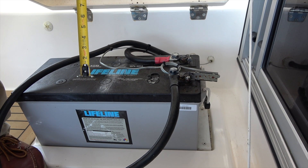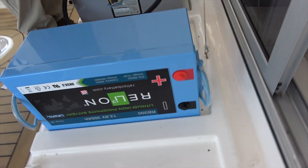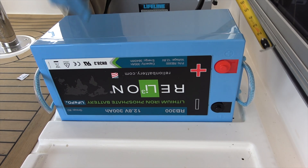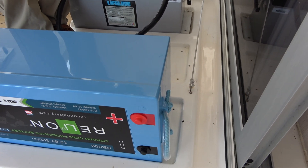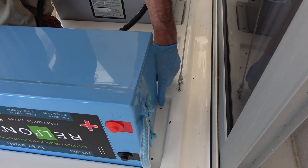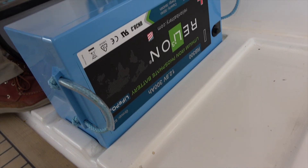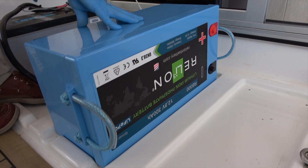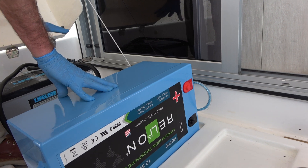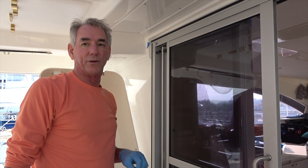The Relion won't fit in the standard orientation because it is wider than the AGM battery. What we've done is put it on its side, and on its side it fits perfectly in the slot. There's a slight gap up forward, so we'll cut a small piece of starboard and place it right in there to give a nice solid platform for that Relion. We'll have one, two, three lithium batteries. The lead-acid is still here temporarily for 12-volt power while we finish, and then 1200 amp hours of lithium-ion should be more than substantial for living on the hook.